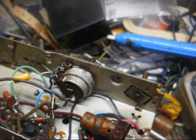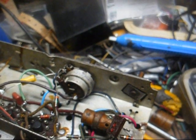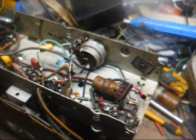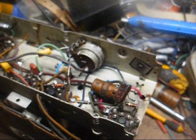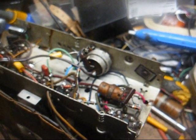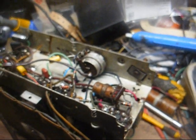However, once the power switch is turned off and the radio is left plugged in, your chassis will then become hot because the hot side of the line will be connected to the series string tube filament line, and the final tube in that line, the 12SQ7, the end of it will be connected to chassis here. And what they taught us in electronics is you have maximum voltage across an open circuit, so that makes the chassis hot when the set is off. Now, the way we can get around that is to move the power switch to the hot side of the line, and assuming you have the radio plugged into an outlet that's wired correctly, the chassis will not be hot even if the set is turned on or off. It won't make any difference. It still won't be a hot chassis.